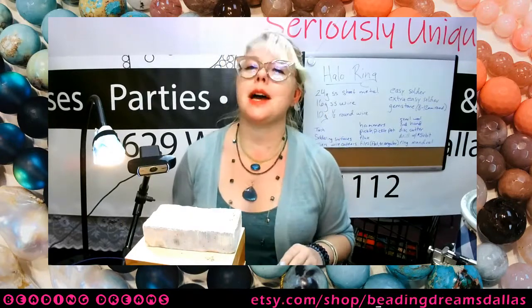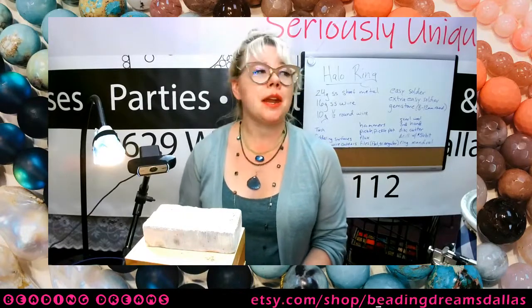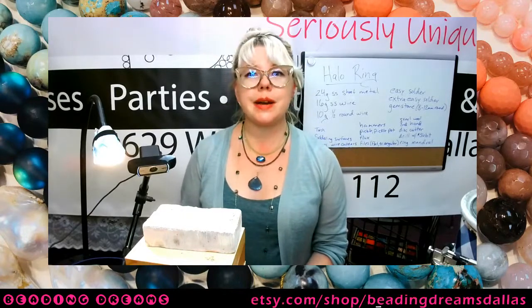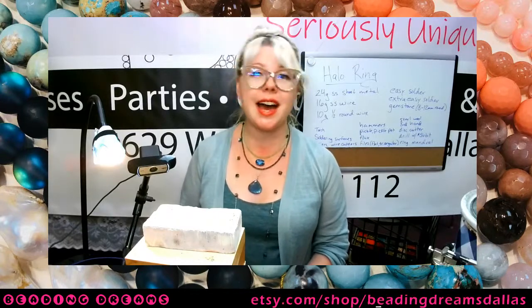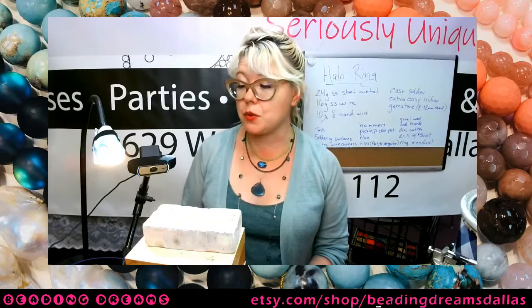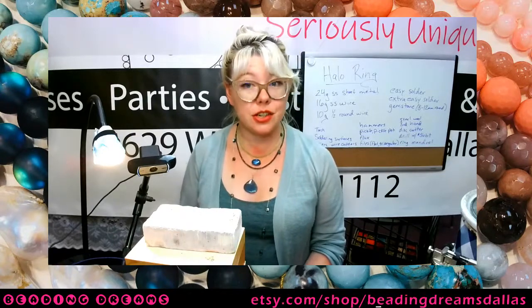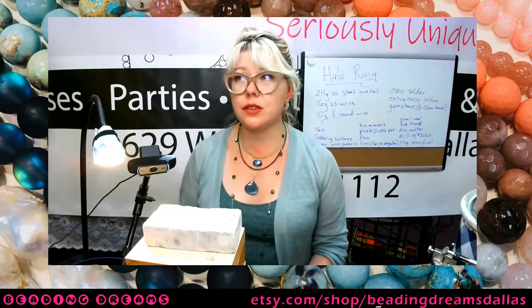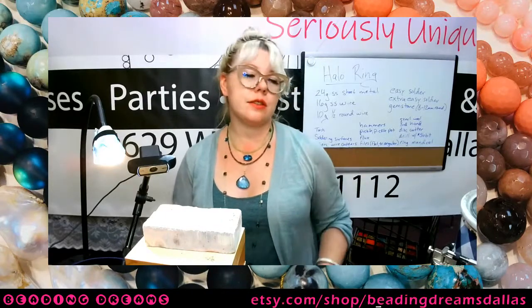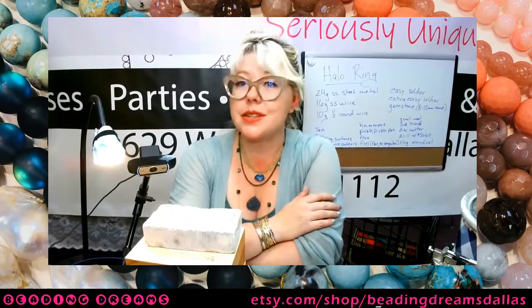Also, I am about to light a torch. So before I cut my solder, let's do the very quick 5-point soldering safety lecture. Number one, try your best to keep 6 to 8 inches of clear space around your soldering station at all times. No, I'm not doing that. I've got cameras right up in my soldering station space. That totally bit me in the ass last year when I melted my webcam on stream. So seriously, if you have things you care about, including your house, keep 6 to 8 inches of clear space. As long as you do that, the chances that you will accidentally melt something or set something on fire are significantly reduced.